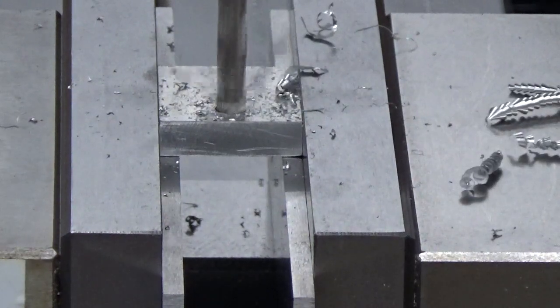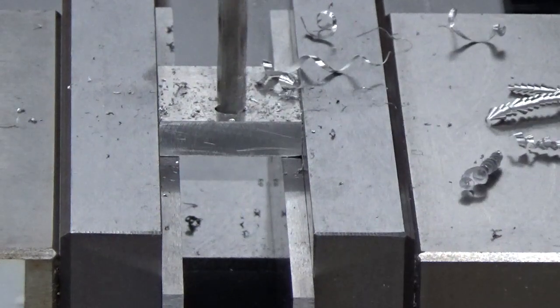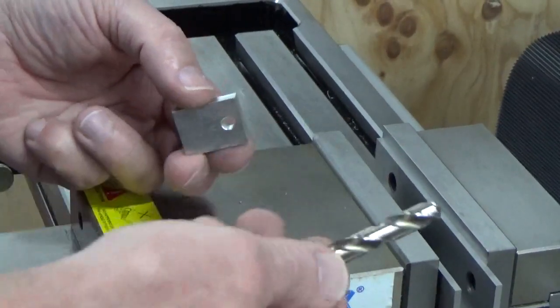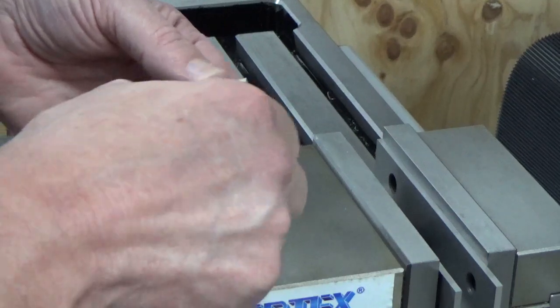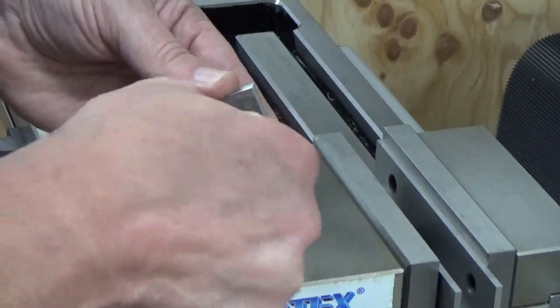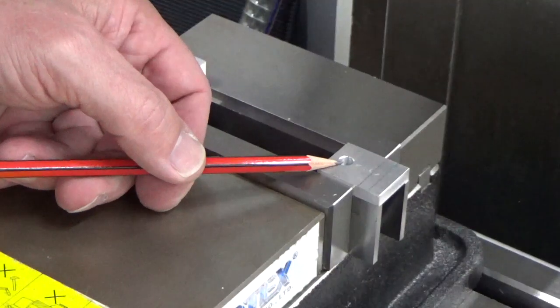I'm just taking a try — I'm doing a breakthrough like that, and that's it. I've got a hole through. So what I've got now is just a larger drill bit — this is 10mm as opposed to the 5mm we were using before — and I'm just going to wipe it around, just to deburr and make sure there's no sharp edges on there.